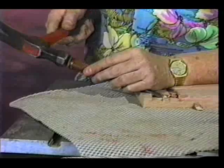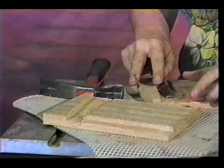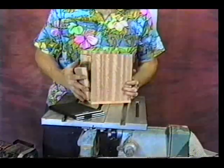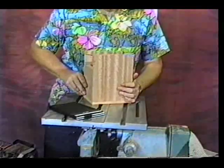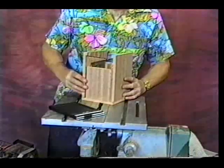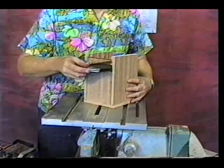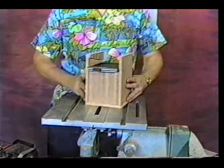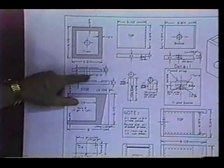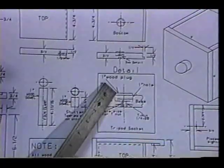We have to use a board for a guide to make the angle cut, and it's easier at this point to use a chisel to knock out that last little section in between and make sure it's smooth. Here we're setting the pieces together making a trial fit. This shows how the camera is going to go together and ensures the pieces are all going to fit when we nail them. They're all going to fit, so now we're going to drill all of the holes. We use a one inch spade bit and come through and drill the front.